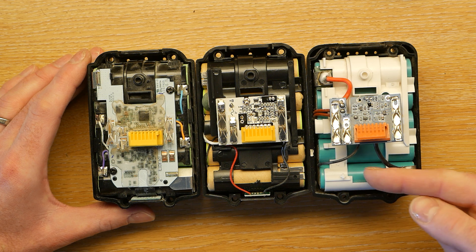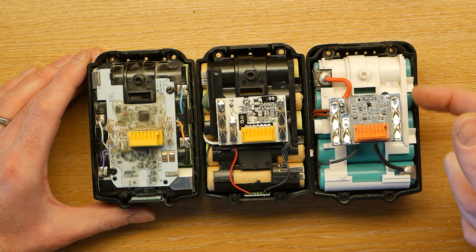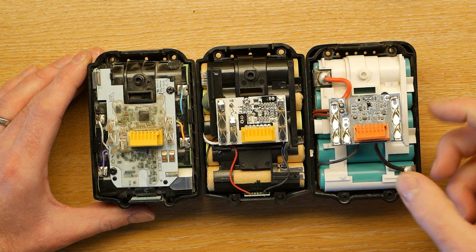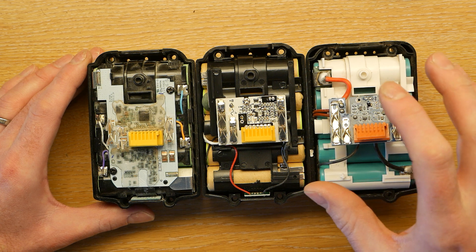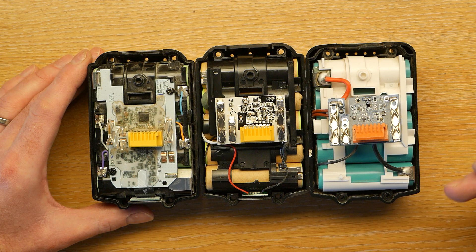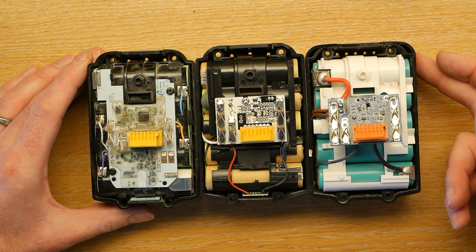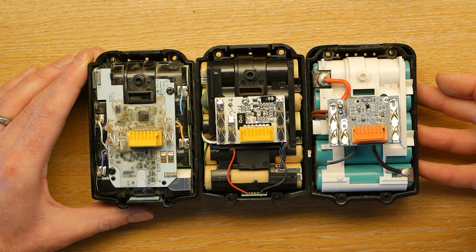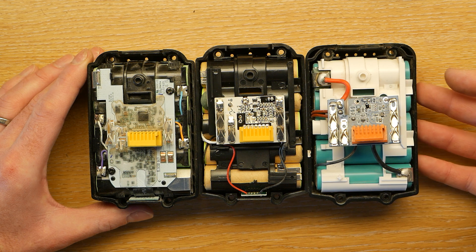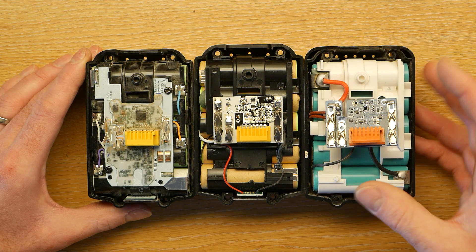I've had this clone for about a year now, and looking at the voltages along all cells they're already very slightly different, even after a full charge. So if you really want to keep these for a long time, you could actually look at soldering on cell balancing and bringing out a cord that you could use with a separate — for instance, a model aircraft charging controller — that could actually properly cell balance these cells.